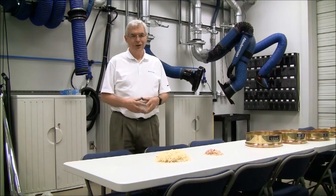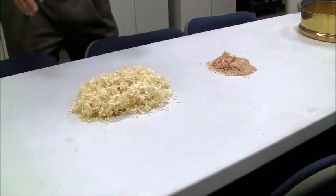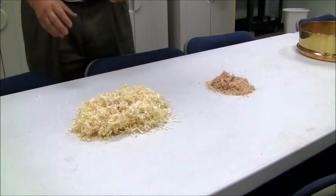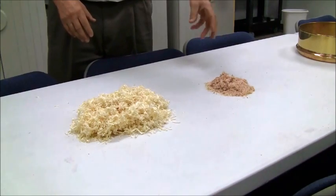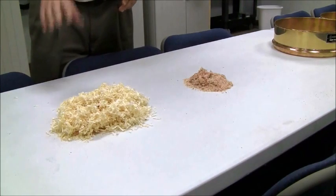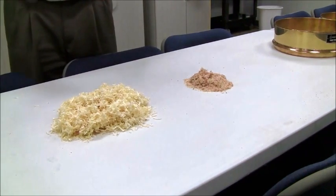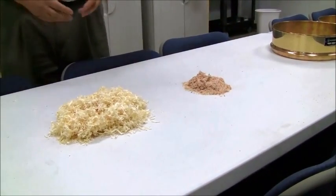We will demonstrate here what size criteria we're dealing with — what is combustible. On this table we have two samples. One is planer shavings, fine planer shavings, and the other is a mixture of mostly sawdust with a little bit of sanding in it. On this side, the planer shavings are too big to cause an explosion, but of course if you put a match to it, it will burn.